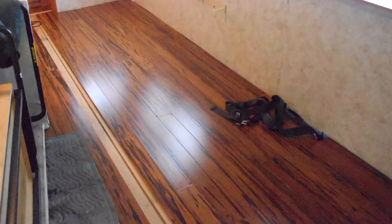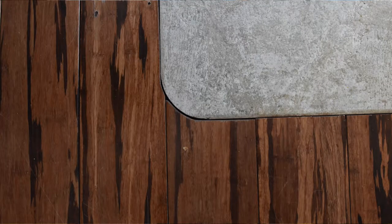So I said fine, I'll do the full thickness, and it worked out really well. It's been a really tight floor — hasn't moved around a lot, there aren't big gaps. There are a few small gaps that come and go as the climate changes; here in Arizona at 16% humidity the wood shrinks a bit, but in more humid climates it swells back out. The flooring has been really stable in the tight corners too. For underlayment I used 3/8" under a 3/8" floor, which worked out perfectly over the tile.